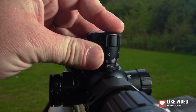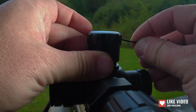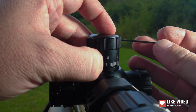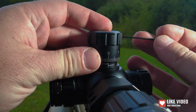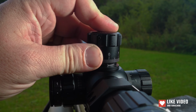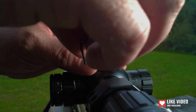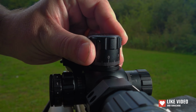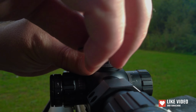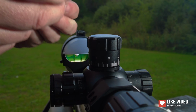for the erector tube system there. And you're going to do the same thing with this. Just tightening with the zero on the witness mark. Remember, there's a witness mark underneath. I'm going to drop that down to find it right about... right about there. Yep. Again, just snug on the Allens until it engages.